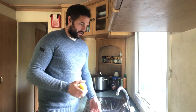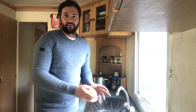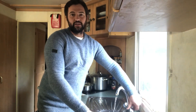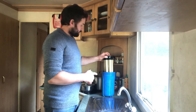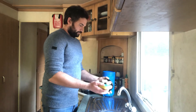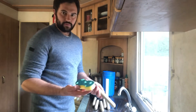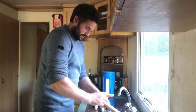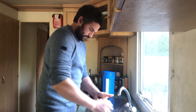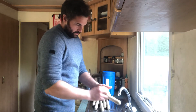We're going to clean this ceramic filter using a scouring pad sponge. I have to run water first to fill a bucket before I take the filter off, because once the water's off I won't be able to clean it from the tap. So I run a bucket of water first and then clean it from that. Here's the filter and a clean scouring pad — I like to take them all off individually to do this, it's easier. Dip it in the bucket of water and you can see it starting to come off.